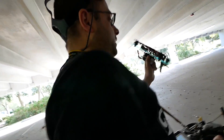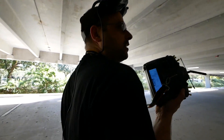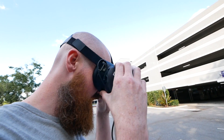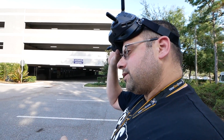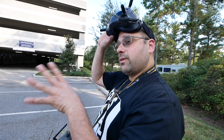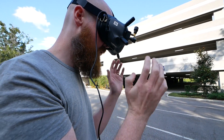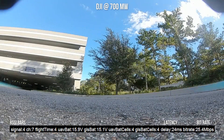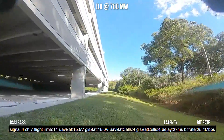You're doing Crossfire for control and DJI goggles for video. The reason to use Crossfire is that if you have quads without DJI in them, you'd need it anyway — so you may as well put all your quads on it unless you're going to go all-in on DJI. I don't want to carry two controllers. This new firmware also lets you step through 25, 200, 500, and 700 milliwatts — but we're going straight to 700. I run 4:3 aspect ratio because the camera is natively 4:3; going 16:9 just cuts off the top and bottom, so why reduce your field of view?